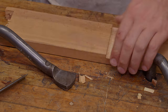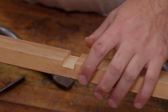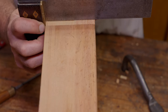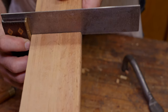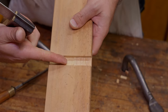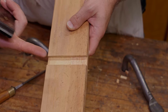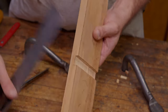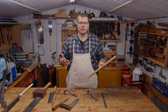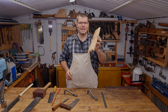If we take a quick look at this: you can see down to the line there, down to the line there. A square on here — we're fairly square right through from corner to corner. It is a little bit undercut in the center, but that doesn't matter. Just like when you do dovetails, undercutting in the middle means nothing really. It's just whether it looks nice and neat on the outside edges, which is what you want. So there you have it folks — that's how easy it is to cut a dado using hand tools.